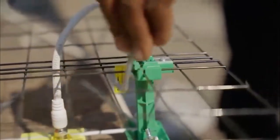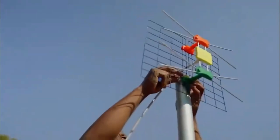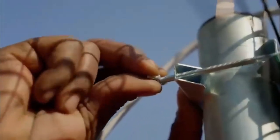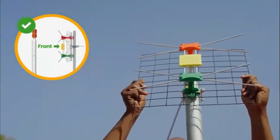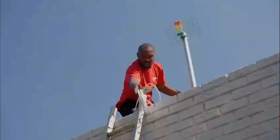Using the indicator sticker as a guide for placement, place the U-bracket through the middle of the antenna. Then, mount the GoTenner to the pole like a traffic light with red on top and green on the bottom. Use the brackets provided to fasten it in place. Aim the front of your GoTenner towards the transmitting tower to ensure you receive maximum signal. You may want to look at your neighbor's antenna as a guide.